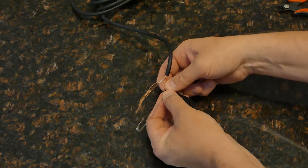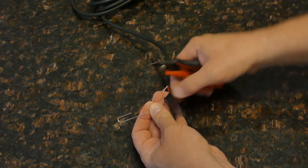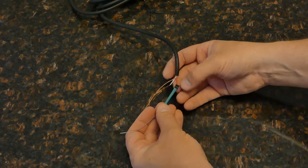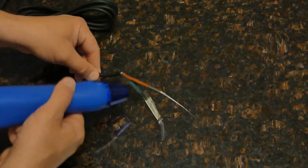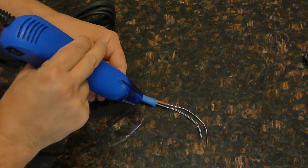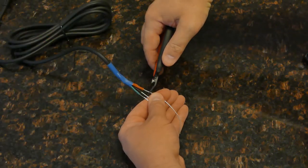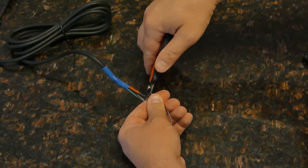To keep the copper and the paper clip from slipping apart, I recommend taking electrical tape, wrapping a loop around, pressing it completely flat, and cutting off the excess. Although it's not pretty, your cable is technically done — but I highly recommend using additional electrical tape to keep everything together and fatten it up a bit. Personally, I always slide heat shrink around each and every one of these wires for a more polished look and better insulation. Add colored heat shrink to each pin so you can keep track of which pin is which. Adding a piece of heat shrink around the entire thing gives it a really polished look. Trim down the amount of cable sticking out to no more than about 3/8 of an inch — about the length of an XLR pin.